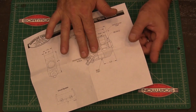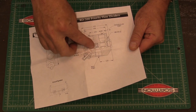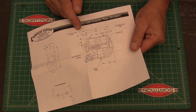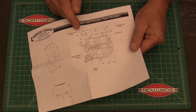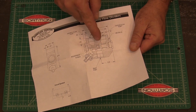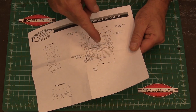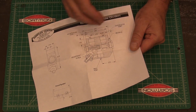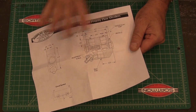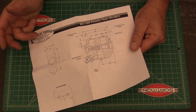The way I'm going to plumb this is: I'll bring my inlet in here, my priority flow will go to the valve I'm using for my rear hydraulics, and all the excess flow will just go back to the tank. You could also send the excess flow to another valve or something like that, but I just need to decrease the flow from 10 to at least 8 gallons per minute.